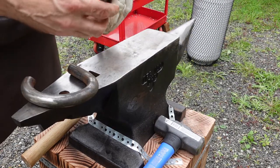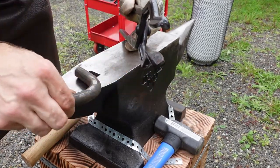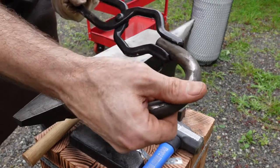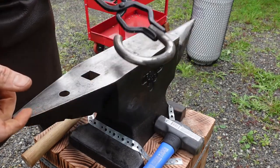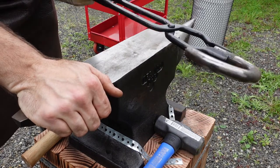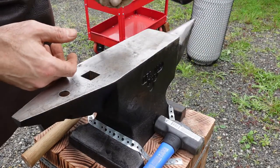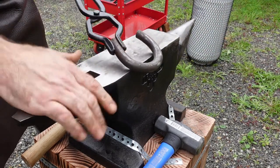As I was saying, these are specialist tongs. They have this V groove here on each side so that they grip nicely and wrap around your round and square stock. I can get a nice solid grip on them that holds tight. Bang them and clang them around, and I can turn them easy. It's harder with the glove on. I've practiced without. But I can roll it around in my hand a little easier to get that nice rounding effect that I like to try so much.